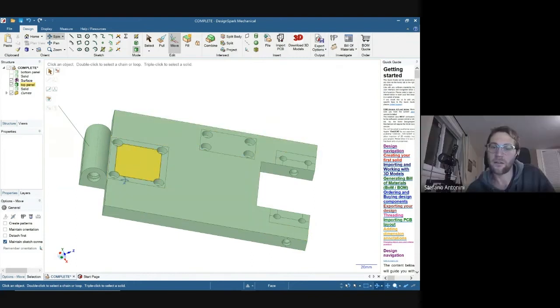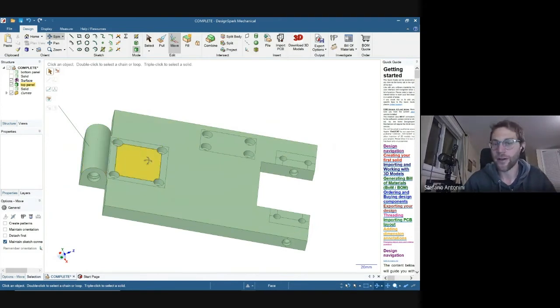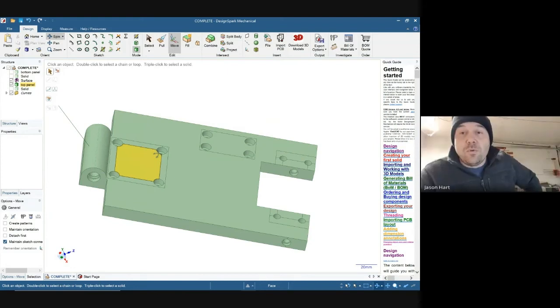I don't know, are you using heat press inserts or anything like that in there? No, because we're not using these, we're not using these, and we're not using these. These were just backup plans in case we couldn't. The only ones that we're using are these, which are just holes for screws to attach the mount. Yeah, that's even easier then. I was going to say, if you were using those, the oblonging that you can get from printing a hole standing up would actually work to your advantage if you're going to use a brass insert, like a heat press insert, which I'm a big fan of if the application can benefit from that.